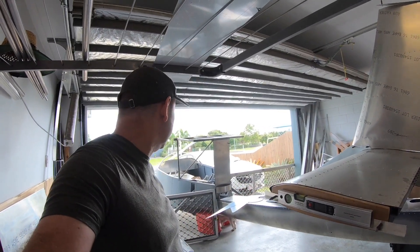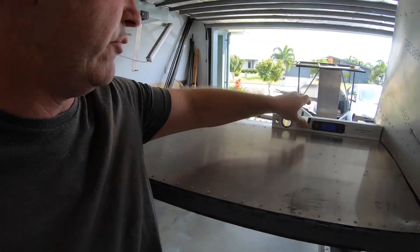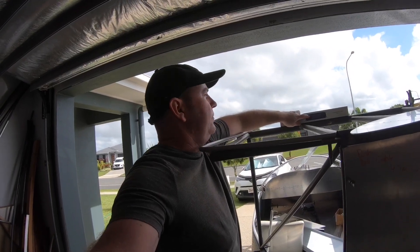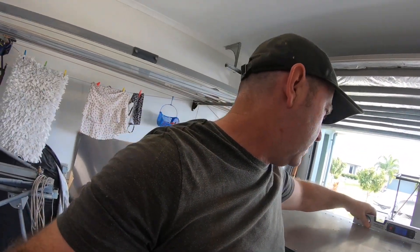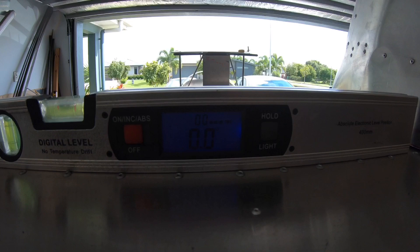Everything is all in line, so I'll measure this side, go across, measure that side — they should be exactly the same. I do have a little tolerance I can work with, but I'm very finicky; I want to get it exact. What I love about these digital levels is you can get them so accurate. All you need to do is zero it here — if I want to level that tail, I pick a level reference line, which is technically my datum, zero it out on there, and then put it on my horizontal.